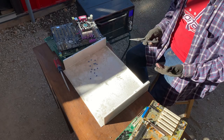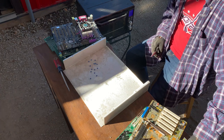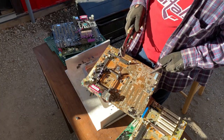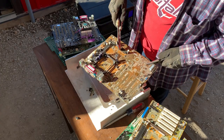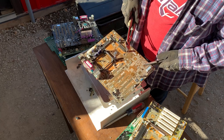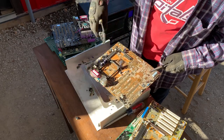As we take it out, it's going to cool down pretty fast because it's only about 30 degrees Fahrenheit outside today, so when we take it out we have to act fast or everything's going to bind back up. The pins that were freed of the plastic have all let go and are now in the pan or in my sorting pile. But everything that these plastic pieces are still touching — they're still all here. My experience is if these plastic pieces are still on the motherboard, you will not get the pins to drop this way. I highly recommend taking these plastic pieces off prior to heating it up.